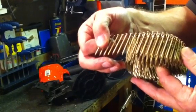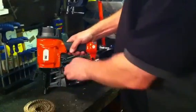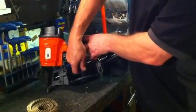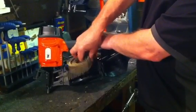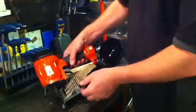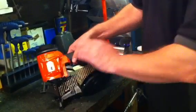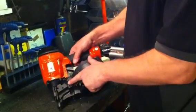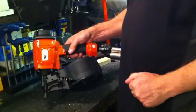If I load that on, as you can see I can adjust the base of this pod to help support the coil of nails. Place it across, head's in the top, close up the pod. If that door doesn't connect freely, then there's something wrong — just double check it before you start again.